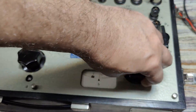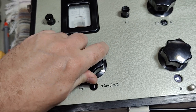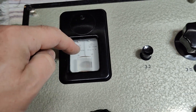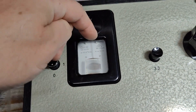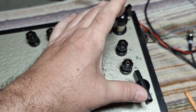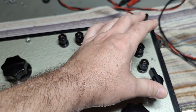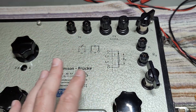I think what you do is you dial for zero on one of these — that's just the range. And you dial for zero, and then you have an external potentiometer here which is also where you dial. You reach zero on that meter — the point is you adjust the external resistor to reach exactly zero on the meter. When you have this, this resistor here is a factor of the unknown — I think it's a factor of one, ten, or a hundred of that resistor. That is the unknown resistor, or something like that.